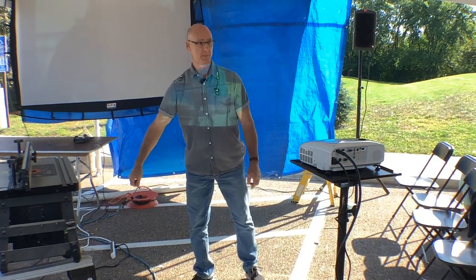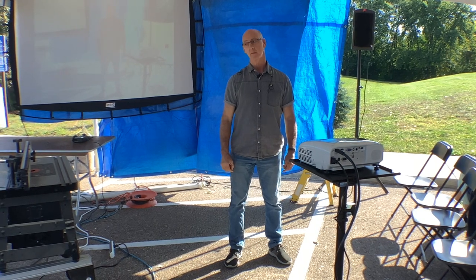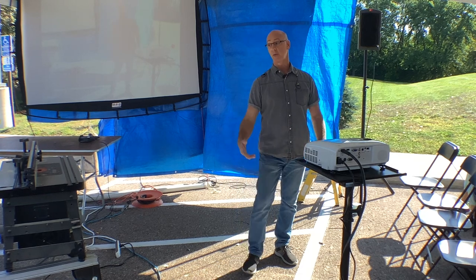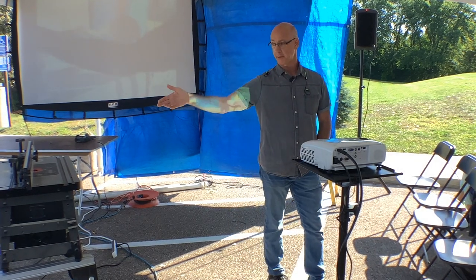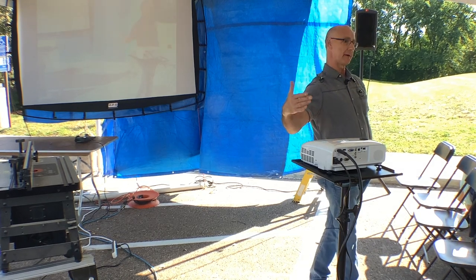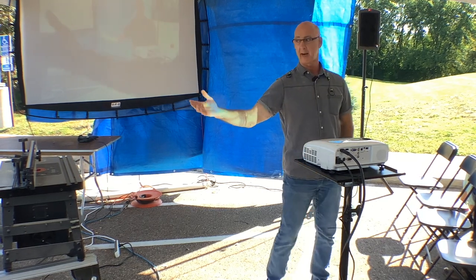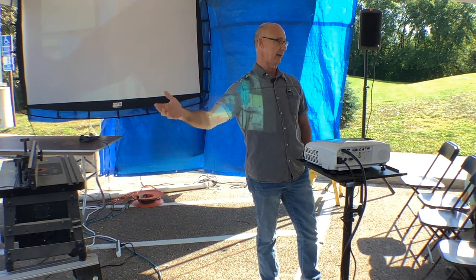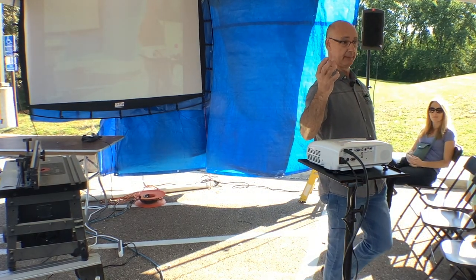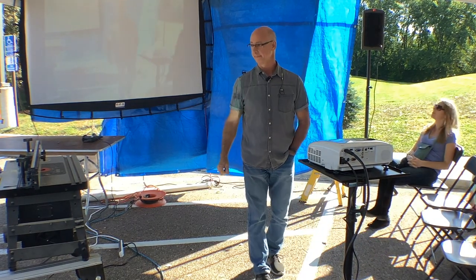Do you have any issues if you ever cut more than half the diameter of your bit? You want to kick out or anything, or are you always less than half of your bit? Well, when I'm doing a rabbet, I chose a 3/4 inch bit for this 1/2 inch material. So I'd like the diameter of that cutter to exceed the size of the rabbet that I'm producing. If I'm doing a 3/4 inch rabbet, I'll still use a 3/4 inch bit, and then you're still going to be okay. So is that what you meant? Yeah, just because of the way it's cutting.